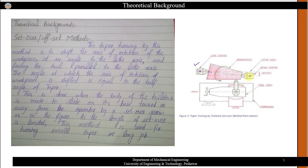The initial center of the workpiece and the dead center on the tail stock are offset by a certain distance. Due to this offset distance, the new axis of the workpiece shifts, and this shift corresponds to the half-tapered angle. You have to feed the cutting tool parallel to the axis of the lathe.